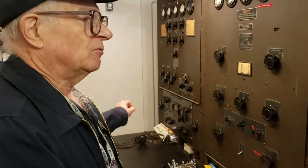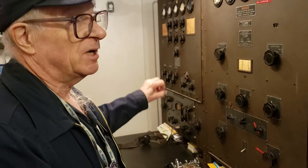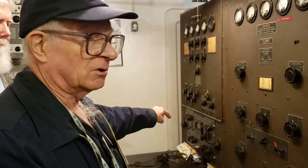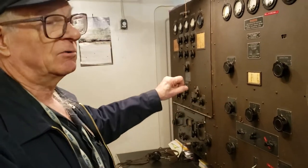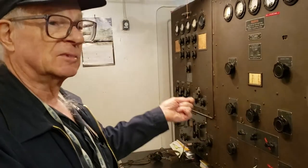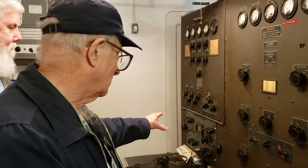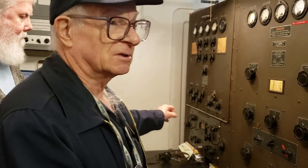And one of the guesses is that the Navy wanted it, or maybe MARAD wanted it, because it has extra shielding so that local oscillator and IF signals don't leak out to the antenna, where they could be radiated and be picked up by an enemy ship. Right. In fact, the model number of that, SLR, means shipboard low radiation.